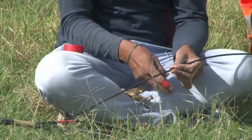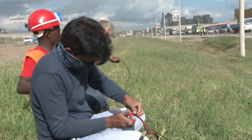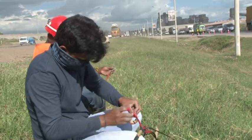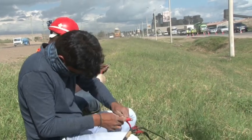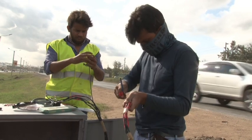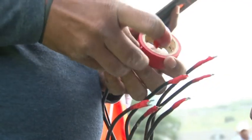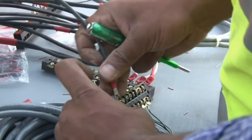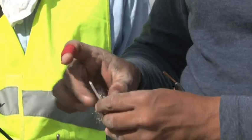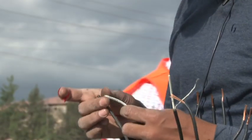The next step is to trim the ends of the loop and piezo connecting cables. All wires should be of equal length, otherwise it will put extra stress on the connection bar installed inside the cabinet, and any connection may get loose. Connect the U-shaped connectors so that they can be connected to the connection bar. The inner wire serves as one terminal and the mesh serves as the other terminal.